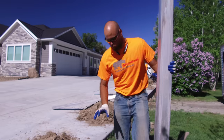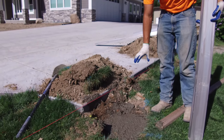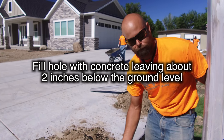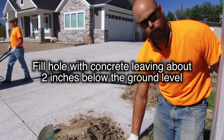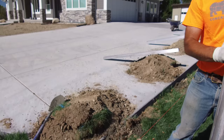Once you get your concrete in the holes and you're getting ready to set the channels, you want to make sure on the height of the concrete that you leave it as high as you can. Typically we like a couple inches below finish grade, which will leave room for some dirt and sod to be able to grow over the hole and hide the concrete.